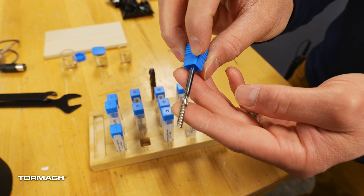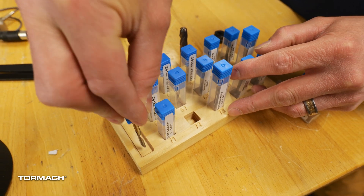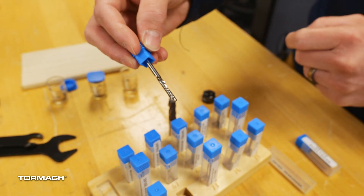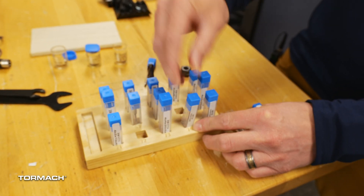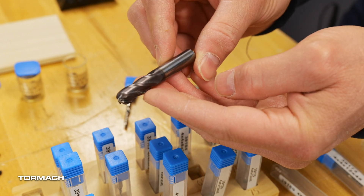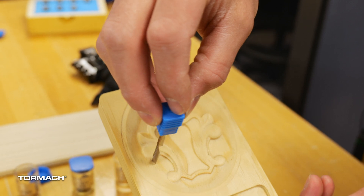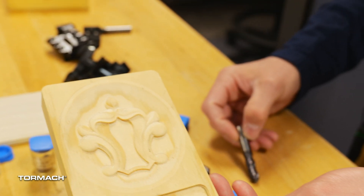This is a perfect example of a one-flute flat end mill — one flute, flat on the end, so it's going to have a flat effect as I'm cutting, which is perfect for cutting pockets. Most roughing passes and hogging out material use something flat on the end. This kit also comes with a ball nose end mill. Here's a half-inch ball nose end mill — you can see it has a ball nose on the end. These are great for 3D carvings: you hog out material with your flat end mill, then come back with a 2mm ball nose to get those nice curvatures and turns.